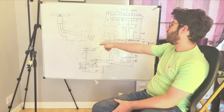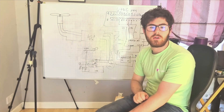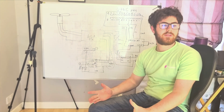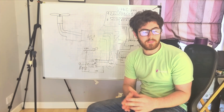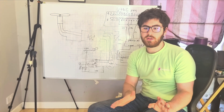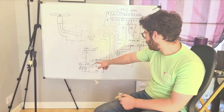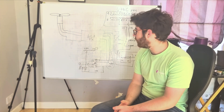We then put the power from the battery into this 40 amp drone ESC, which will control our motor. Unfortunately ESCs don't just power things by themselves, so I needed some circuit to control it. For that, I've got this circuit down here. The way a drone ESC works is every 20 milliseconds, it receives a pulse between 1 and 2 milliseconds. If it's 1 millisecond, it's fully off, and 2 milliseconds is fully on — it's gradual in between. This uses a timing chip and a potentiometer to make it the specific length we need for the pulse.